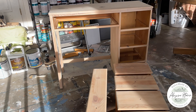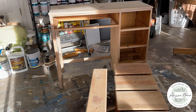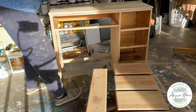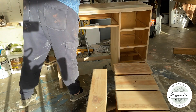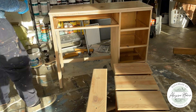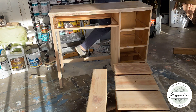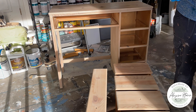I used a simple spray polycrylic on the body and the drawers just out of convenience — it sprays on evenly, there are no brush strokes, and it doesn't drip if you don't go too close. On the top, I used a round sponge, swiping from one side to the other. Once evenly distributed, it dries beautifully with no brush strokes. I got it in a matte finish, and the matte in combination with the colors from our process really works great to give the look we're after.